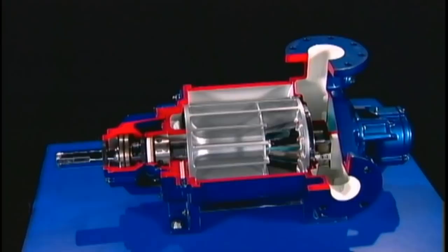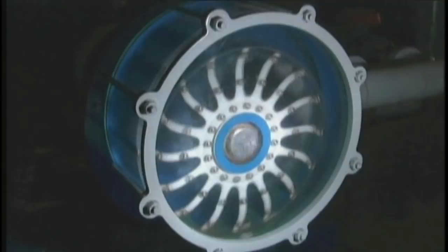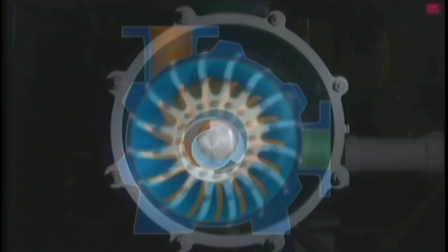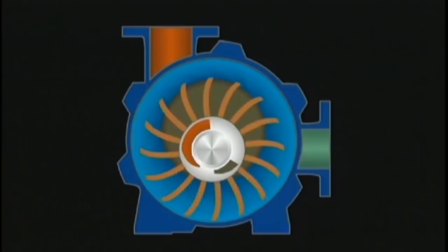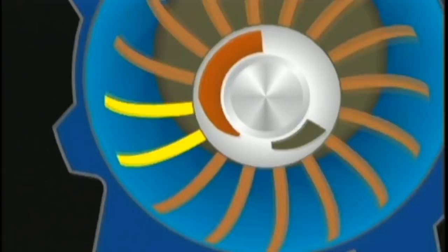In this demonstration pump, you can see how. When the rotor begins to turn, it forms a rotating ring of liquid that follows the inner contour of the body. In this diagram, you can see that the rotor is offset in the body. That causes the liquid to recede from, and then re-enter, the chambers between the rotor blades with every revolution.